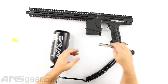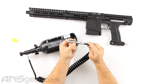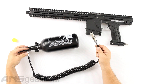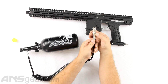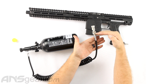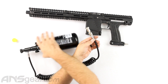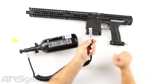This part has the slide check in it. There's a little assembly right here that can move front to back, and this controls the gas flow out of the end. We've already turned our valve on, so air is coming through the coils and to here. If we have the slide in the rear position, it will stop the gas flow and will not let it come out the other side. This allows us to connect or disconnect our hose from the gun without having to turn the air source off.